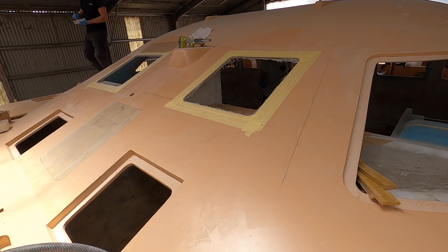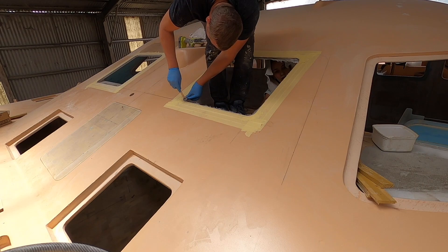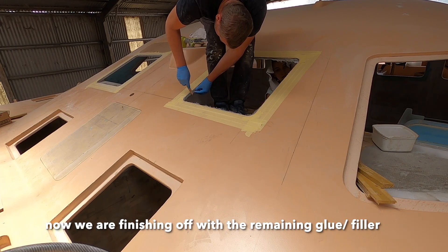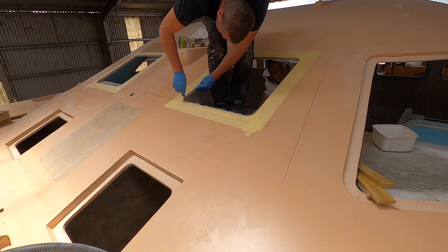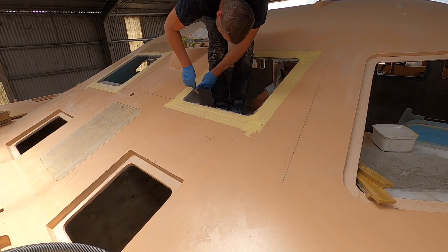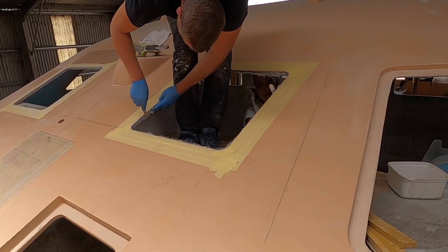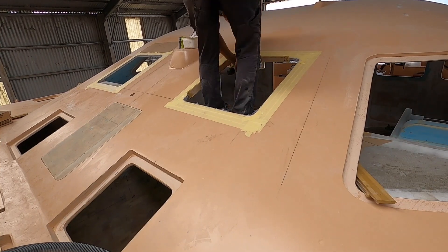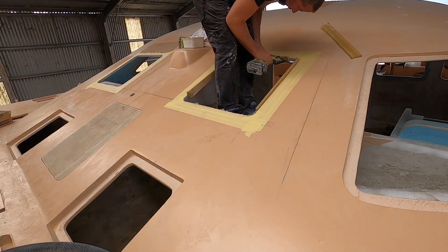By this time the situation and our fingers got very sticky, so unfortunately we missed recording the part where we insert the fiberglass into the channel. We want the glass on the inside, sort of squeezed in with one finger, and then the bog applied after. Then we attached the wooden battens covered in tape to keep the fiberglass and the filler in place.